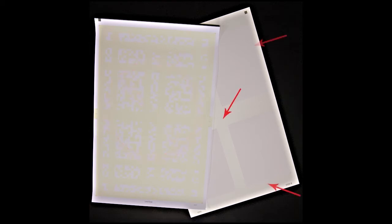During your design process, please keep in mind that printing over or applying any treatment, such as UV coating, to any of the glue areas will render the glues ineffective. The glues will no longer seal even if you properly apply pressure. Convertible Solutions can provide templates letting designers know exactly where the glue areas are. These can be found on our website simply by downloading them.